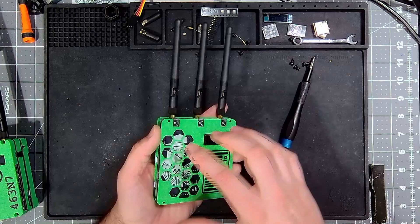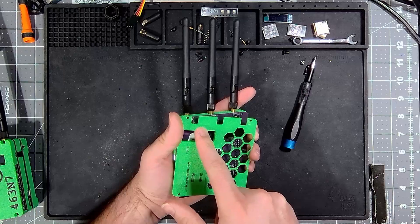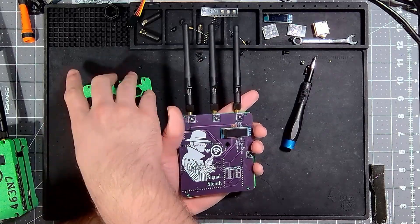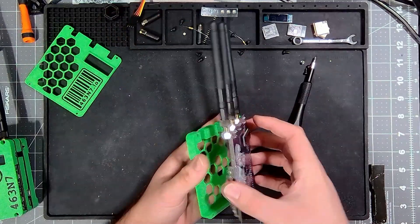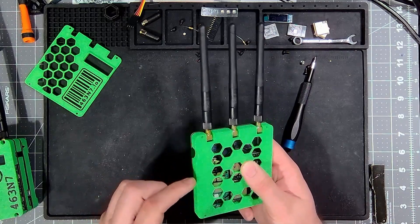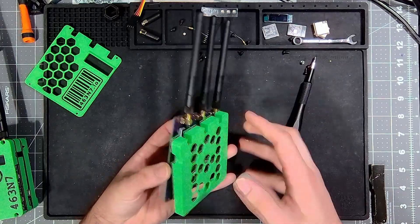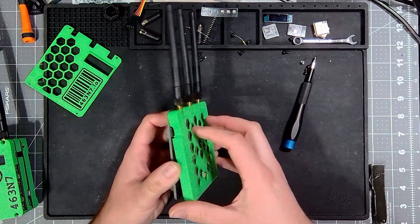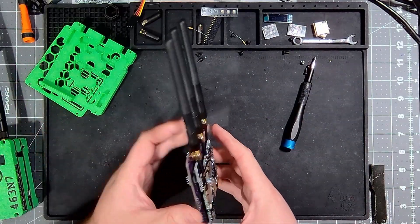It just came apart from removing the three socketed screws. On the back of the case, I made indentions everywhere needed for all of the soldering points, so it should fit just perfect. This back case is only about two millimeters thick — I thinned it down enough where I even had to completely cut out holes. I haven't made a mod or addition in the case for the GPS antenna; I wasn't really intending to put it on. I wanted it to be as closed as possible, but if you're interested I can add that cutout and may go ahead and add it as an additional download.